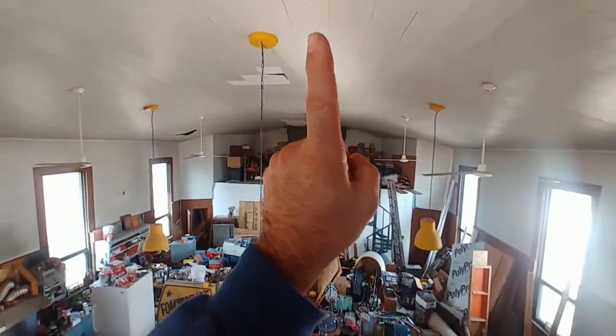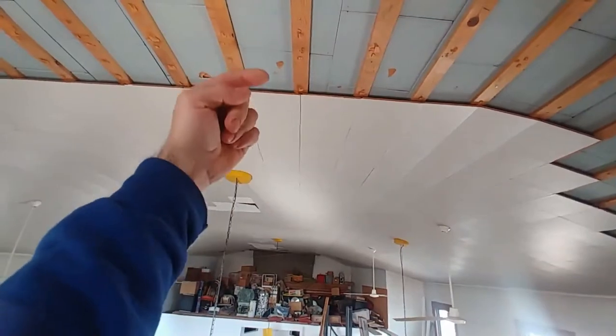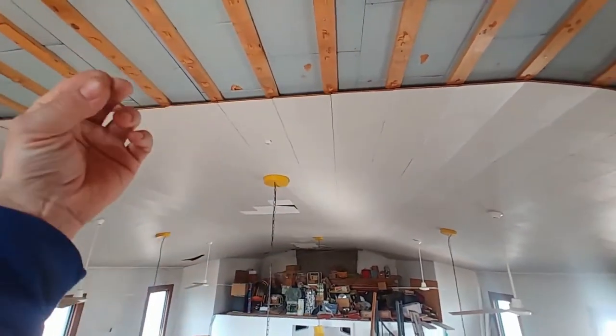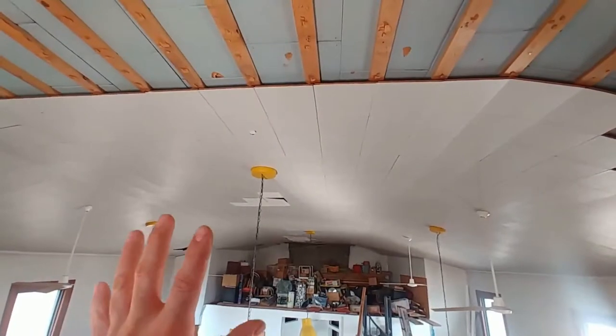However, I do see the merit in that wall attaching to big thick blocking from one rafter to the next, or one truss to the next truss, so that it's helping to hold this up out here and that it's not bouncing so much. See, if we only anchor to the furring strip, then a little bit of that bounce goes away, but it's still pulling and bouncing on that furring strip because it's quite thin and chintzy and old. And what I'm thinking is you'll have collateral cracking of the drywall here constantly from walk traffic up here that you don't notice is bouncing a little bit, but it's just too much for the drywall to take. So we want to take as much bounce out as possible.